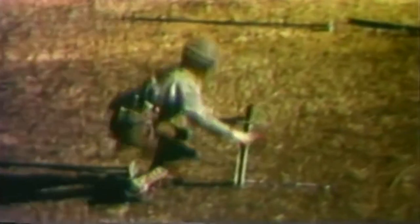Next, the poles are distributed. The positions of the stakes are located by laying one pole and one stake end to end, with the inner end of the pole touching the main frame. This distance is approximately 9 feet 8 inches and determines the proper location for the placing of the steel stakes.